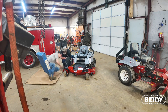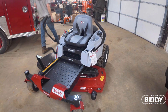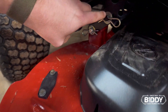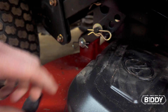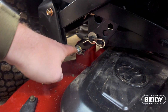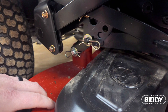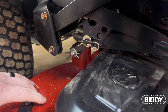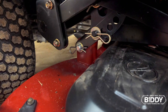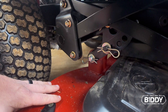So what we did to level this deck on these Quests is come over here to the side — you've got one of these on each side. You've got a pin here and it's got a couple different options on holes. So what we did was we put the deck on three, and we want to check the back of the deck first. We want to make sure that the back is as close to three as possible, or a little bit above three. So you adjust these pins to where you can be right above three inches.